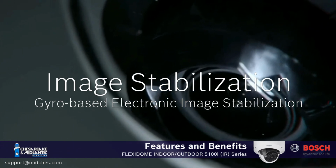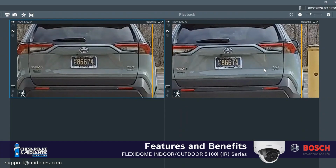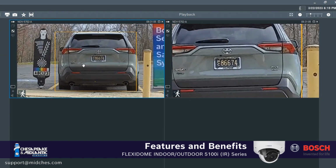Let's talk about image stabilization. We talked about this thing having electronic image stabilization. What does that do for us? Well, it puts us in an environment where we could put a camera like this on a bridge, on a pole, in a tunnel, environments where we had to use a pan, tilt, and zoom before, where the cost goes up dramatically because only those premium cameras had electronic image stabilization. Now it's actually built into this camera. Same thing with vibrating poles and parking garages, all those things you don't really think about until you put a camera there, and then you realize how much that vibration plays on the image. So a huge plus for this camera to add that feature and bring it to the table in this mid-series.